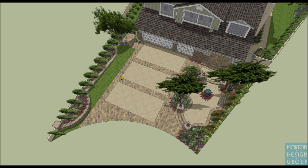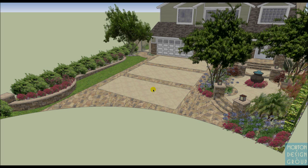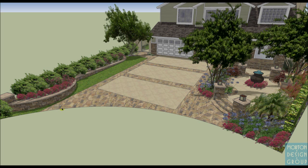In the driveway, you'll notice I've gone to an 18-inch wide stone band where we have plenty of room to work on either side of the existing cracks and brick banding. We'll be able to saw cut the existing concrete fields and maybe do a sandblast and color acid wash or color wax to change the color a little bit. I'm doing random flagstone banding and solid flagstone down here towards the apron of the driveway and the entryway.